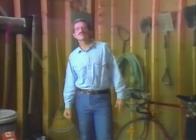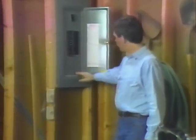Let's take a look at our service box to see what additional circuits it might handle. Now, as we said, service panels come in various shapes and sizes. This one is a 200-amp panel. As you can see, there's plenty of additional space for extra circuit breakers. If you're planning a remodeling project and have anything less than 100-amp service, you may have to consider installing a new panel and then contacting a licensed bonded electrician or local power company to arrange for a new service drop.